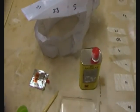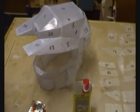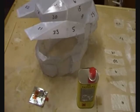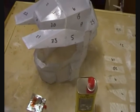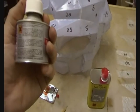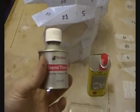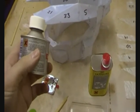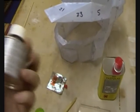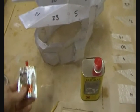Now obviously you will need to use ventilation in an area. In the workshop I've actually got ventilation built in, but it's a bit noisy, so I can't actually use it while I'm recording on that. Also, things like the thinners, just be mindful of that as well. This has got something called naphtha in it, which is like a petroleum. It basically smells of petrol, and it is an irritant as well, and it can affect the lungs, so it's always worthwhile getting the proper sort of extraction units fitted in, or to wear the correct masks.